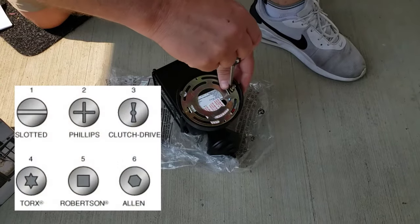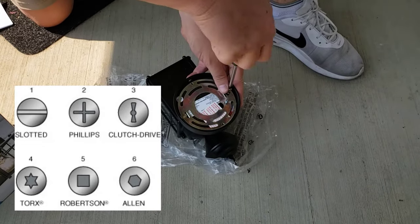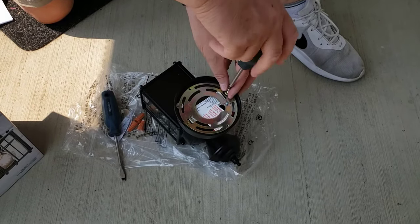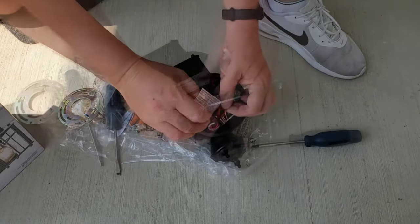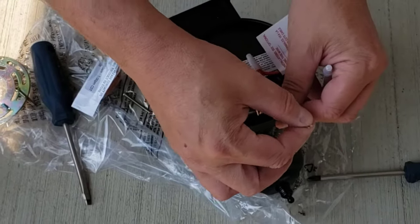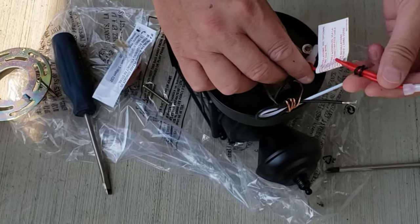With the Phillips — much happier, it won't slide off. I'm working on plastic so I put cardboard or plastic down to stop the finish from getting scratched. Now just pull the wires out. You've got your load — the black, your positive; don't lick that, bad idea. You've got your white which is your return.